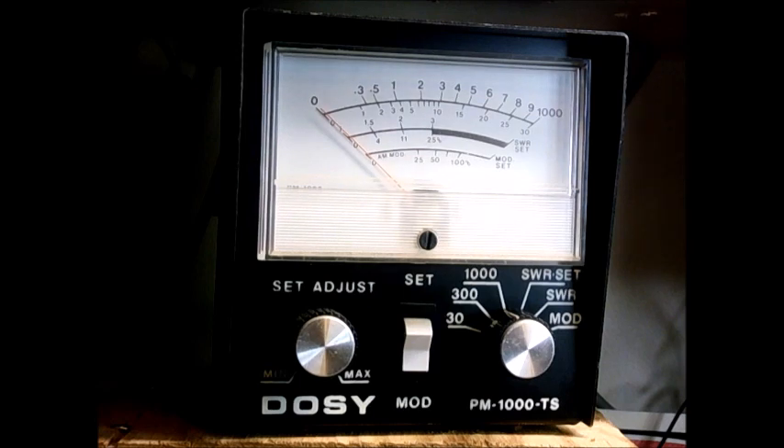Tomorrow we're going to pop three of his tubes in here. If they're brand new tubes, it should make a minimum of what this is putting out. So we have 450 dead key, 550 PEP — that's our target. We'll let the voltage bleed out totally, swap out the tubes, pump in the power, and see what we get. Catch me later.